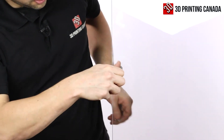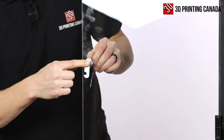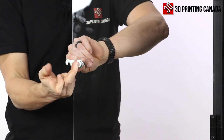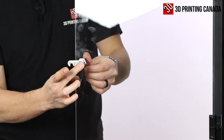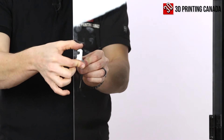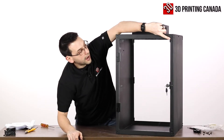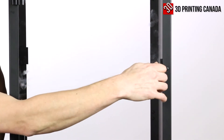It doesn't need to be crazy tight. If we take the screw out of the back, we can attach this bar. With the key in there, we can see how it works — locked and unlocked. We need it to be locked with the bar sticking out the side, and it's going to catch on that plastic piece on the other side. It doesn't really matter how you orient the key when locked — I'm going to have it so that locked, the key is facing the same direction as this panel. Those little plastic braces we added on the top and bottom are just stops to prevent the door from flopping in further than needed, and that plastic one acts as a catch for the lock.